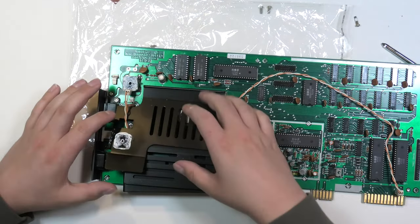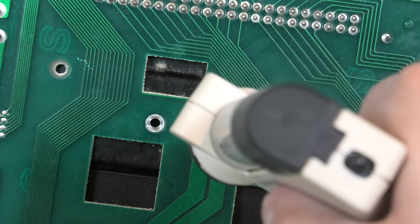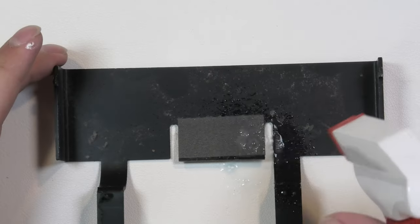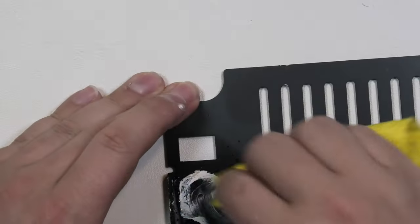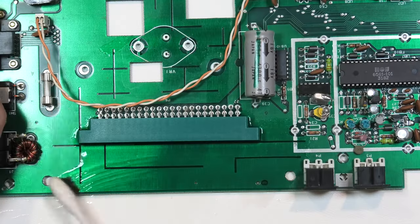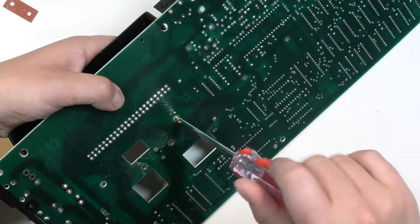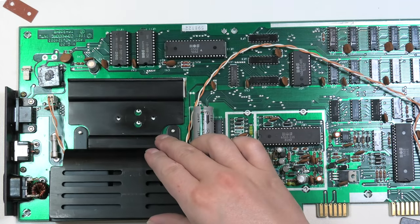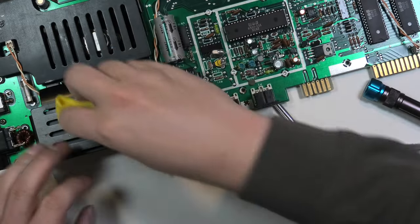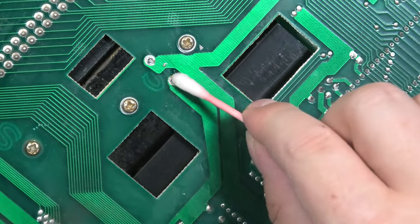I dusted the motherboard and started disassembling the metal pieces that had some thermal paste on them. Then I removed the screws from the transistor, which I desoldered with my pump. There was more thermal paste. I cleaned off the metal pieces which were dusty, removed the old paste, and cleaned the board with isopropyl alcohol. There appears to be a small corrosion spot. I also cleaned the transistor and reapplied the paste — which was a bit messy. Cleaned away my spills and added a nut to better secure a part that was a bit loose, then reconnected it to the board.